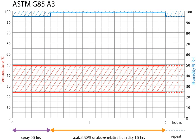ASTM G85 Annex A1 — Acetic Acid Salt Spray Test. This test can be used to determine the relative resistance to corrosion of decorative chromium plating on steel and zinc-based die casting when exposed to an acetic acid salt spray climate at an elevated temperature. This test is also referred to as an ASS test. Test specimens are placed in an enclosed chamber and exposed to a continuous indirect spray of salt water solution acidified by the addition of acetic acid. This spray falls out at a rate of 1.0 to 2.0 milliliters per 80 square centimeters per hour, in a chamber temperature of +35°C, maintained under constant steady-state conditions.